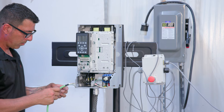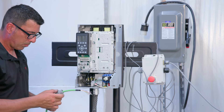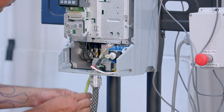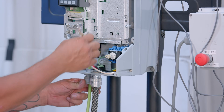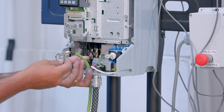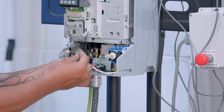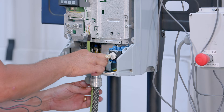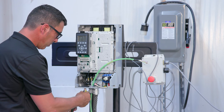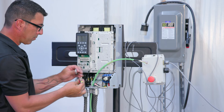From your bag that came with the VFD, take the motor power connector and install as shown. Be sure to follow proper wiring instructions in your operator's manual. You will feed your motor power cable up through the bottom of the VFD and wire it to your motor power connector.